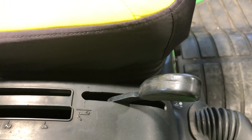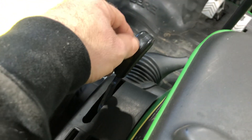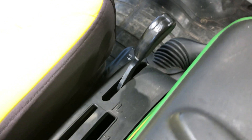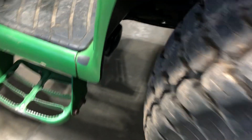I can show you where the lever is on the John Deere 4210. If you get it from the dealer at factory setup it's going to be right here. If you're sitting on the machine it's on your right side, next to the joystick for the loader. You would pull back to raise the deck up and push it forward to go down. That's all running through these two hoses, which follow over to a simple hydraulic cylinder under here next to the main filter.